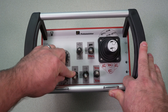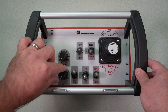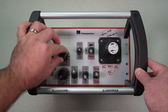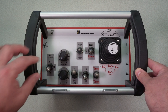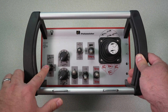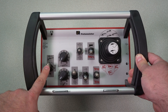This is your water pump switch. It is a lift-to-actuate switch as well. It does not have to be lifted to be shut off. This is your feeder speed select dial — this changes the speed of the belt rotation. This is your main speed select dial — this would change your main belt's rotational speed. This is the belt switch. It turns the belt on — lift to actuate. This is for the main belt on only in the center position. Lift to actuate farther forward is the main and feeder.